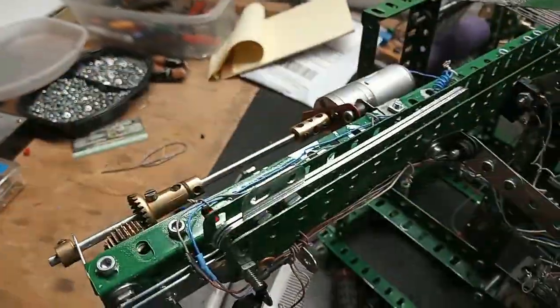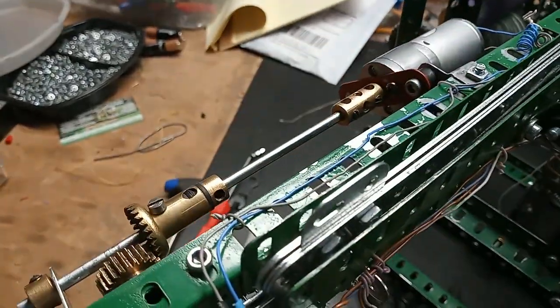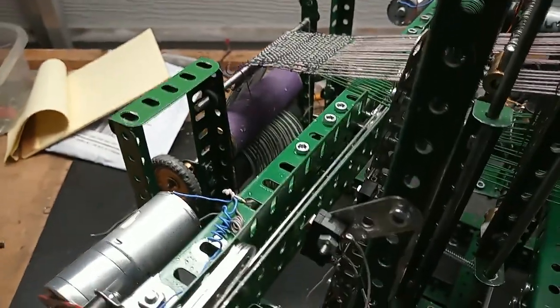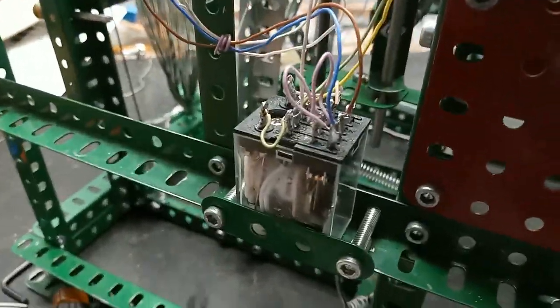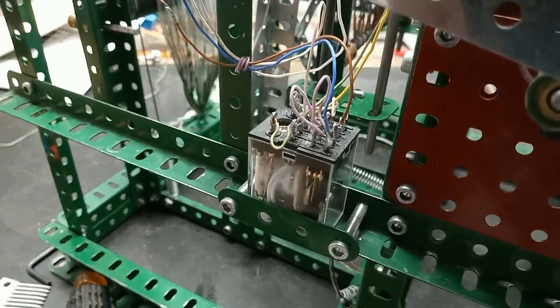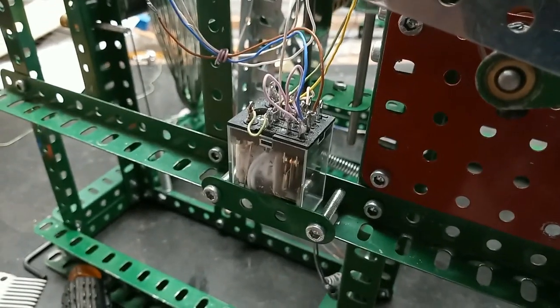This is one of the picks. When the motor runs it drives a chain underneath. That moves the pick back and forth. When the pick gets to the middle it hits a limit switch. That operates this latching reversing relay, and when the pick comes back out again the other limit switch cuts off the power so the reversing relay unlatches.